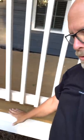Now the handrails and guards. Technically, this handrail isn't grippable — you want a handrail to be a graspable thing, so it's non-standard. You want to check the height of the guard from the top to the floor surface, and the space between the spindles of the guard — you don't want it to be large enough for a child to fall through. You can take measurements on the guard on the stairs as well. On a guard, you want to be able to push it down and out with a load — down is strong, and out is strong. It used to be required in any direction. This feels good.